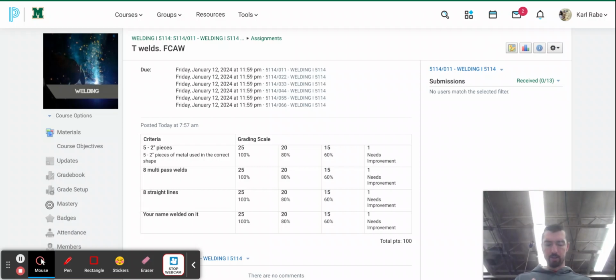But still, how you weld, you need to be purposeful, because when you weld on one side of the T-weld, if you haven't already welded the other side, it's going to pull. So wherever you weld first, if it's not properly supported with tack welds, it's really going to pull and distort. You need to start practicing controlling that distortion.